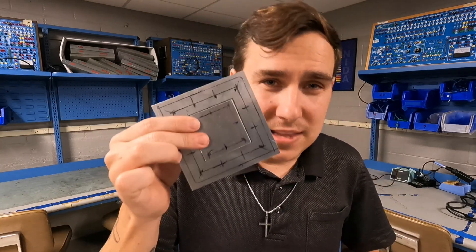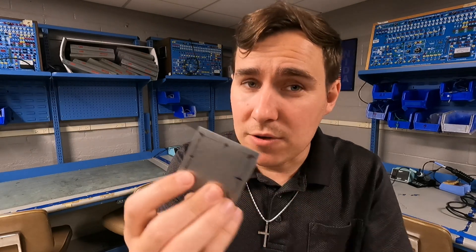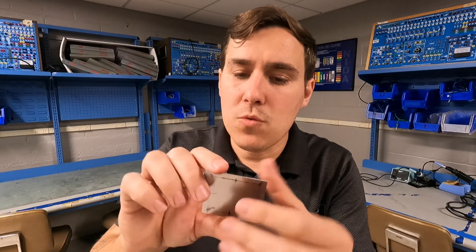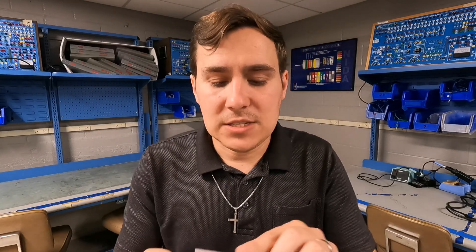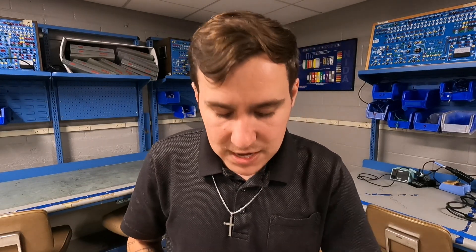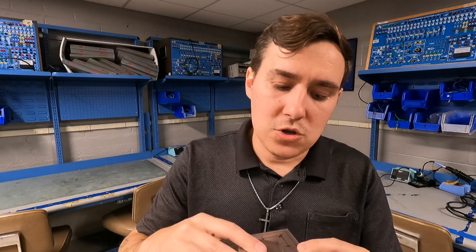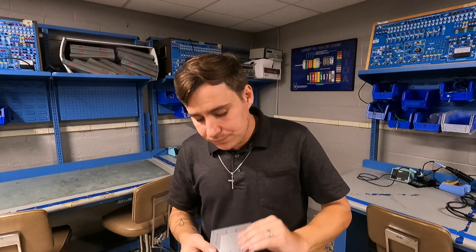The third and really important thing that I kind of ran out of time and didn't cover well: you need to do a really good job of rounding your corners. You don't want sharp corners like you see here on this piece. You want to round off the corners with a nice radius so as not to have any sharp points inside the patch, because that's going to cause a high stress point. The whole point of this repair is probably to remove a crack or damage, and you don't want to immediately introduce more cracks.